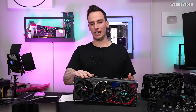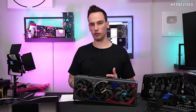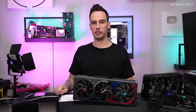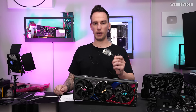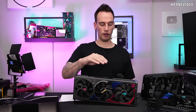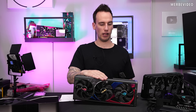Most of these cards allow up to 600W power target, and even during benchmarking you will typically only see a power consumption of maybe 480 to 520W. Usually we cannot reach the 600W power draw, which means we still have some headroom, but it also looks like we are voltage limited. Jay also had the same findings in his video. That's why we will try to hook up the Elmore EVC, which is basically a tool that allows communication with a notebook and the voltage controller of our Strix. It should be quite interesting to see if more voltage helps and then maybe we can see higher clocks than just 3GHz.